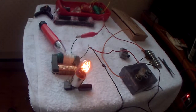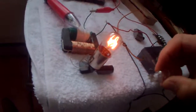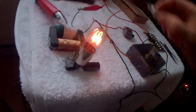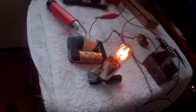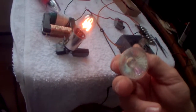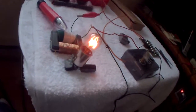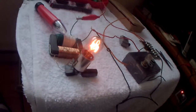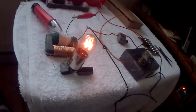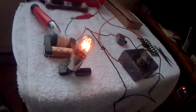It's bright enough to light that microwave lamp, but it'll burn out a bulb like this — this bulb would just flash out. And the 12 volt halogen just flashes when it charges up the cap and then dims out again. These are pretty all-purpose bulbs because they have long tungsten and they take a lot of different frequencies and currents, so they're pretty useful for checking out your windings on your toroid or transformers that you wind up.